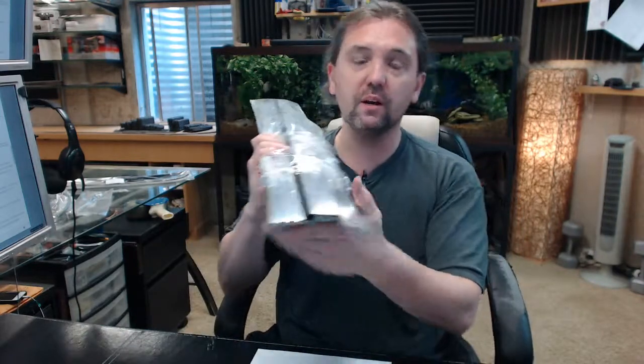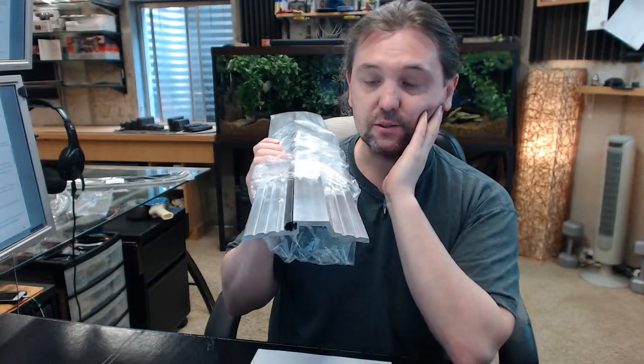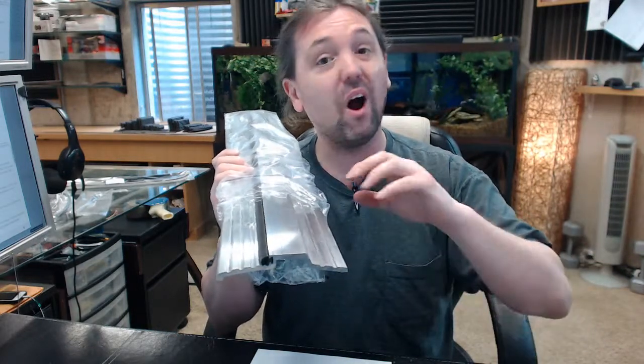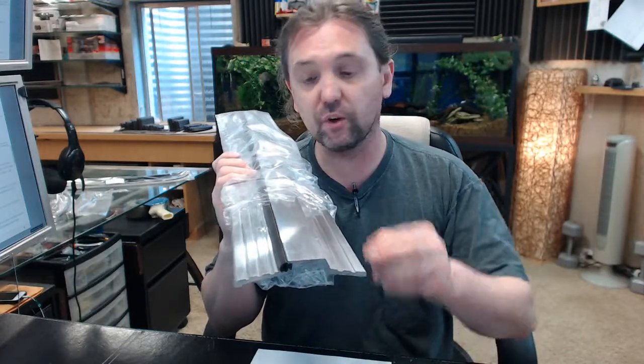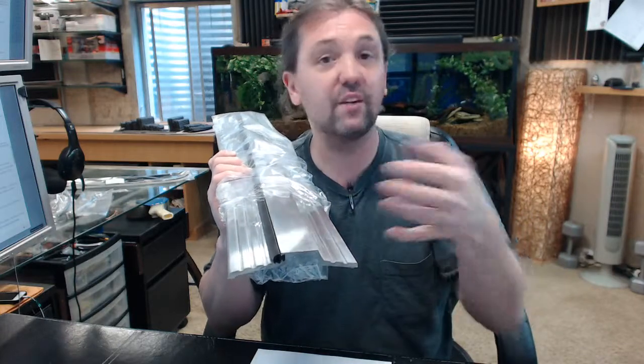You are going to use this where you need a threshold that is, for all intents and purposes, going to last decades. It is heavy duty. It is going to seal very well because of this very durable piece of neoprene. You might very likely see this installed on the back of big box doors where you might have a 100,000 square foot building with several pairs of doors — emergency exits that are hardly ever opened. What you need is something that is going to last, maintenance free, seal very well, and give you a set-and-forget sort of application.